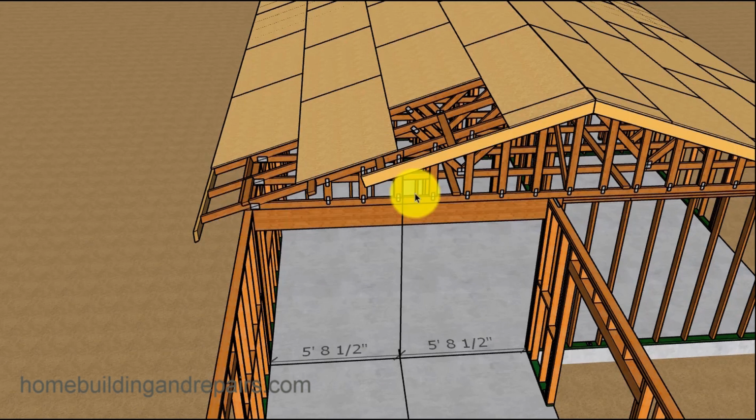I've figured the conventional roof rafters for a situation like this, and been disappointed that the roof truss, let's just say I thought it was a 5 and 12, was like a 4 1/2 or a 4 3/4 and 12. So if you are working with a situation like this, you can figure the roof rafter. Just make sure you double check it.